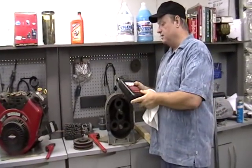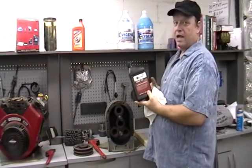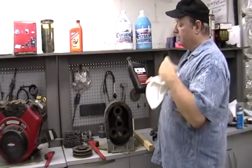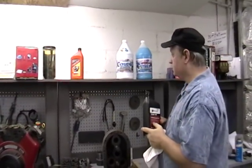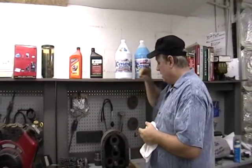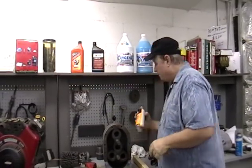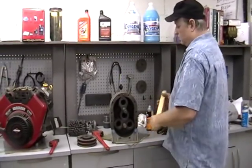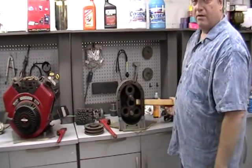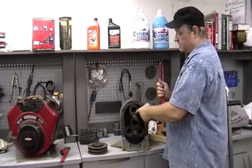The other oil: if it's recommended to use synthetic, use synthetic oil, whatever they say. There is a Mobil One synthetic oil that can be used with the blowers — I'll have to get on the computer and search which one it is, but I think it's a straight 30-weight, not multi-grade. Mobil One synthetic is also approved, so you can get that local if you can't find any. But if the blower needs synthetic, use synthetic, and change the oil whenever it's recommended. Always use penetrating oil — you can get that at the auto parts store. Do a direct hit on the rotor and it'll work every time. Be careful torquing the shaft with a pipe wrench and a cheater bar — you can actually twist that shaft.